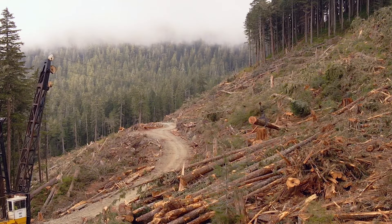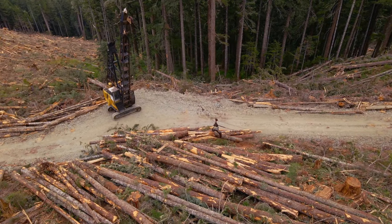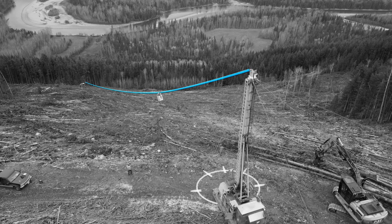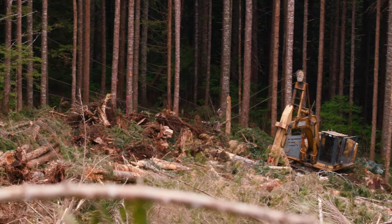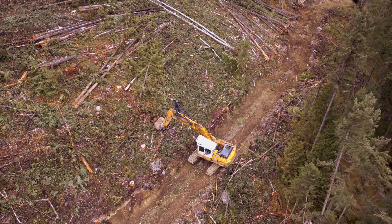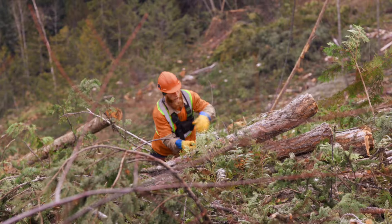You want to match your plan to the machine as much as possible. The yarding machine must be placed so that it will not be struck by logs or other debris pulled in with a turn. It must be secured with guy lines attached to anchors. The running line must be rigged in a straight line from top to bottom at an angle and not directly below or above the yarder. If a tree, stump, or piece of mobile equipment is being used as the back spar, there is a 1.5 tree length no-work area around it, which cannot be entered when the rigging is under load. A well-planned and executed setup is vital to establishing a safe and efficient cable yarding operation.